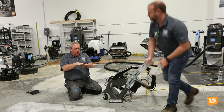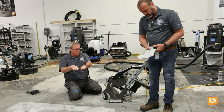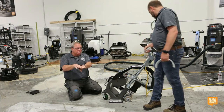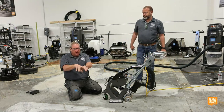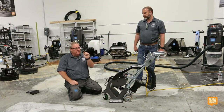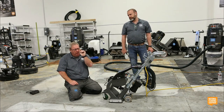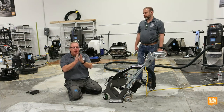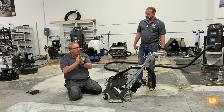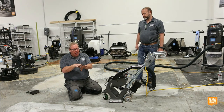But those overlap lines, because you blasted an 8-inch pattern with this machine, then you overlap it just like when you're mowing the yard. You're not going to underlap it and leave grass real tall. So you've actually blasted that twice. Now, I'm pretty good with a blaster. I can make that overlap go little teeny, beeny, weeny. But I've been doing this my entire life. Most guys that first start, they overlap 2 inches, and then they get down to an inch, maybe half an inch, and they're happy with that. But you can't hide those.